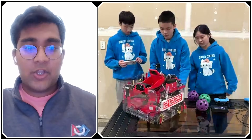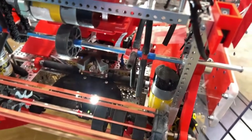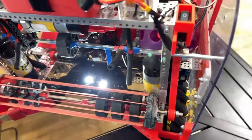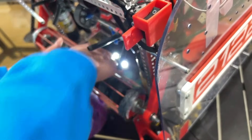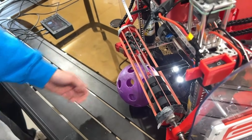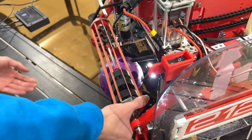Let's jump right into that intake. Our intake consists of rubber band rollers that can really effectively get the ball in, as they're really squishy and compressible. The rubber bands expand and balloon outwards — that was kind of intentional and unintentional. We wanted the rubber bands to be really flexible and intake the ball easily without pushing it away. When we spun the intake at really high speeds, the rubber bands would boom out a little bit, which just helps us get a little more reach and grasp with the intake.